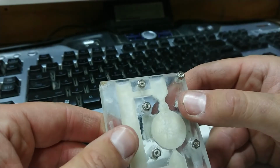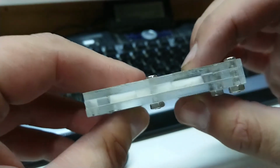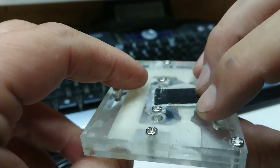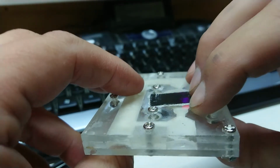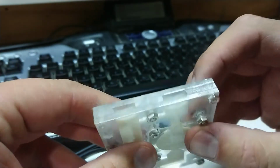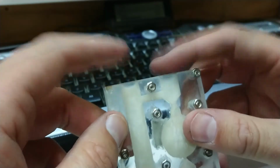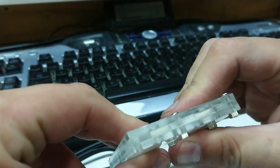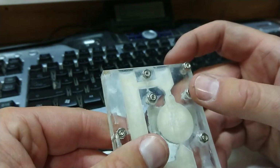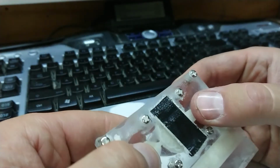I might get away with removing the top layer, but having a good look down here, if you guys can see, I think it's pulled in a significant way, and I need to form that sprue in the plaster properly. So yeah, I might just pour a little bit more wax in there, but I'll do that in a bit once everything's finished contracting and cooling. Hopefully I should be able to fill that gap. So yeah, but it'll be interesting to see how this comes out.